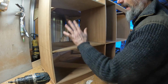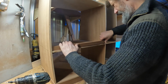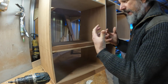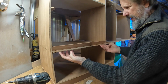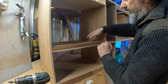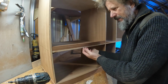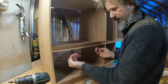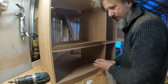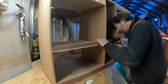Okay, this is the back side of the cabinet. This is where the oven's gonna go. And I'm putting another ledger in here that will help affix the whole thing to the bulkhead. And instead of putting it underneath, which you might think would be normal here, I'm gonna put it up where the oven cavity is, because the oven has a huge void in behind it. There's lots of room here. But here, I wanna maximize this out for a drawer, a pots and pans drawer, that will literally come within a 1/16 of an inch of the bulkhead. So I get lots and lots. All right, so let's just fire this up right here.